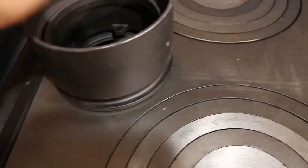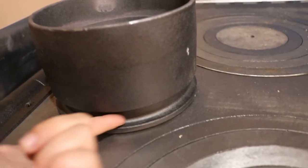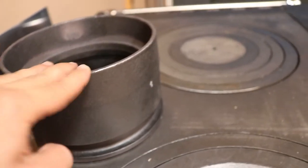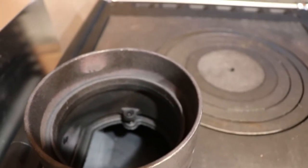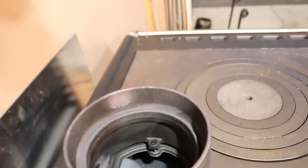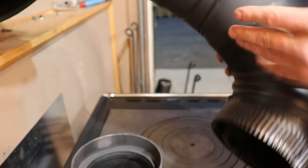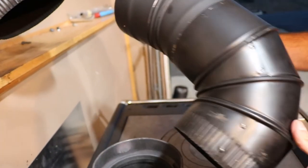People are concerned about the gap at the bottom — it's gasketed here on the stovetop, and it's gasketed at the connection. There's no smoke that's going to come out of this flue collar. From there we can go ahead and connect our chimney into it. This is a single wall chimney, so it's a simple crimped end, and that crimped end will fit directly into the stove.